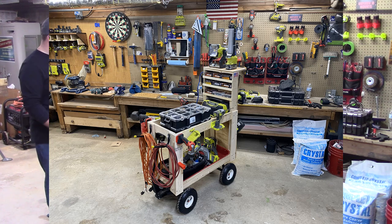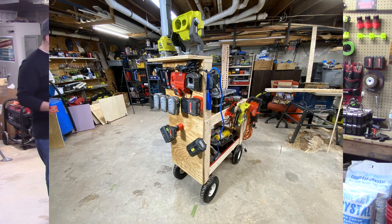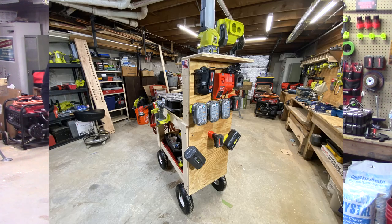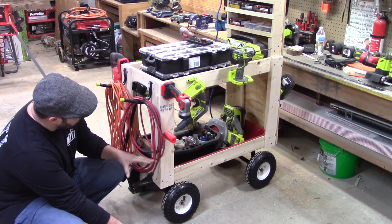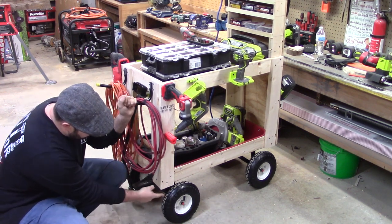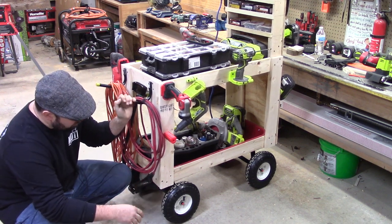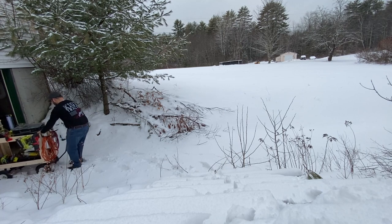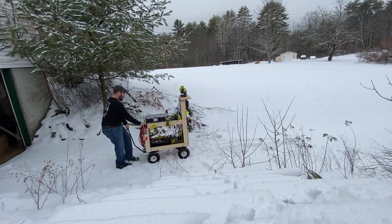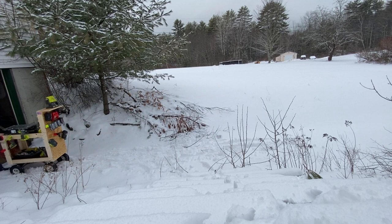It's the finished product. I got to say, I think it turned out a little bit better than I expected, and I hope it turned out a little bit better than you expected as well, especially from my Frankenstein sketches. Let's start from the bottom and work our way all the way up, starting with the wheels. The 10-inch pneumatic rubber wheels really provide great travel over rough terrain, especially outdoors. In that clip, I'm actually moving this through just about five or six inches of snow, and the cart is full — it worked out beautifully.